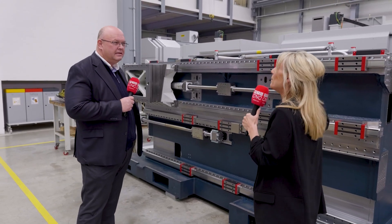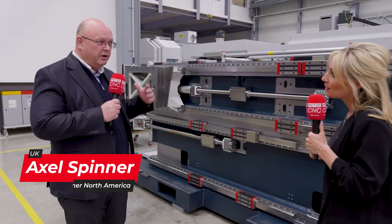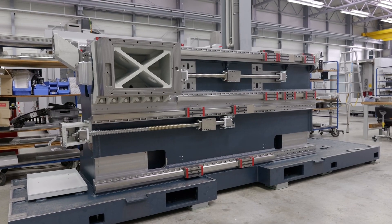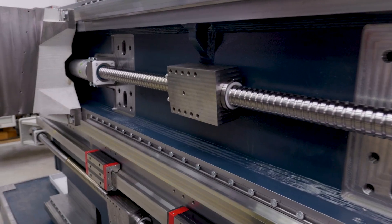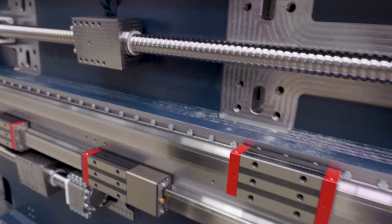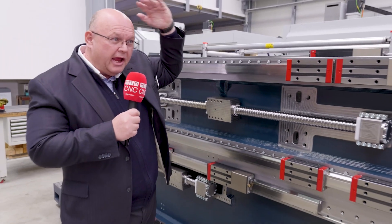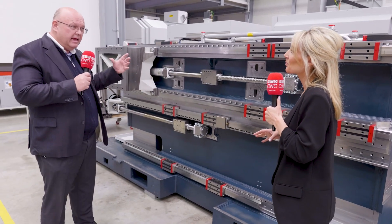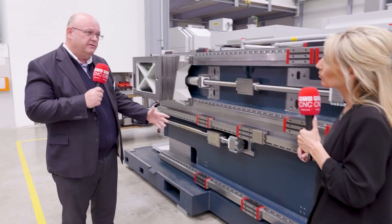This is the back to basics — the build of the TTS range. For a machine in this scale, a very big and very heavy-duty lathe, you need a solid machine base. It's a fully cast machine base, already around 15 tons, with big ball screws and big linear guides. You can see the total height of just the machine body is already nearly my tallness. It's necessary to have such a rigid base to get the performance out of the machine.